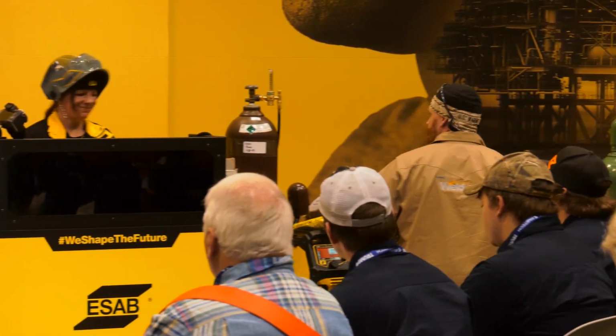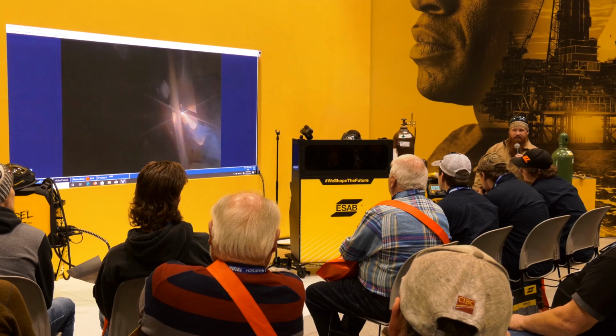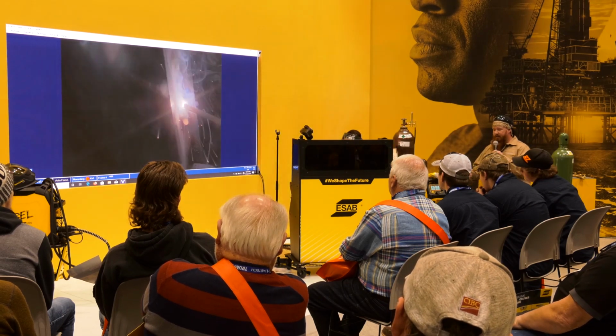Ready? All right, so she's going to go ahead and run a vertical piece for us. So you can see initially how easy and smooth that 7018-1 Prime lights off. I want to say that they have graphite on the tip, and that's what helps that arc initiation process, but it's very smooth. If you guys haven't tried it, I definitely recommend stopping by the General Fabrication Zone. I think they have some over there that they're running. It's a very smooth rod.